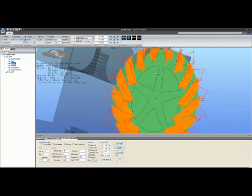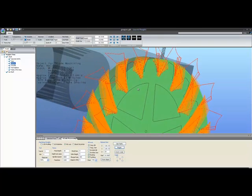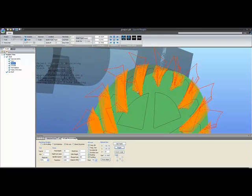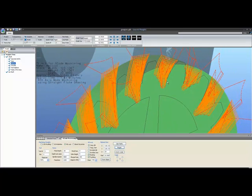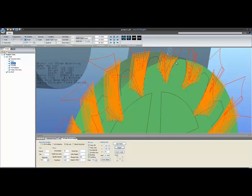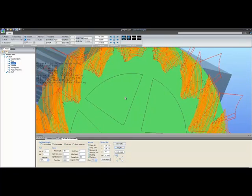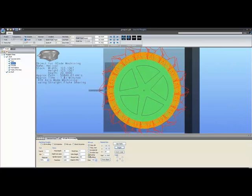But with helicals, you can usually tell if a helical path is correct, because if you tilt to a helical angle, which if you look at this area here now, you can see it looks like I have an involute tooth, an untouched involute tooth. If I just tilt it to the right angle, there's my involute tooth. It looks properly shaped, and that usually is your indicator that a helical gear is properly being cut. Because if you look at a helical gear blank straight in, just looking at the shape of the teeth that you get,